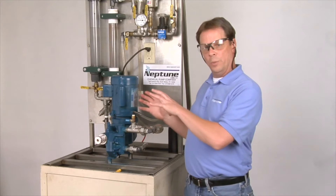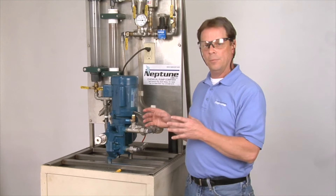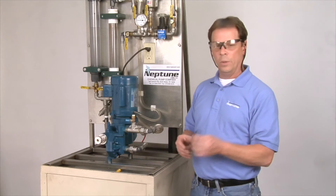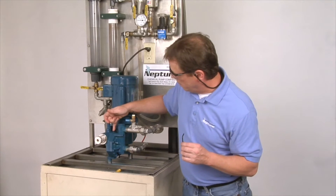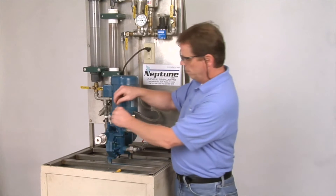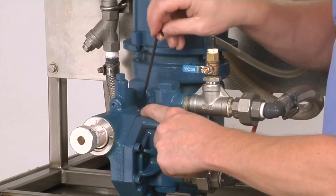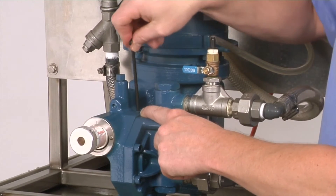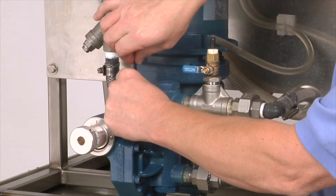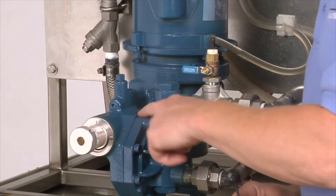When all that oil is being pushed up over the piston, air comes with it. Air is no good to our pumps on either the oil or the liquid side. So to purge the air out, we have an Allen wrench here with the plug that's sitting right behind the diaphragm where the oil sits. What we'll do is loosen up the plug — take your Allen wrench, go to the air purge plug, and loosen it up. Any air that's in that diaphragm area is going to come out.